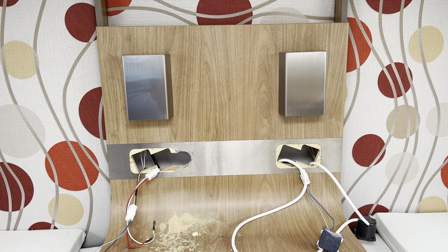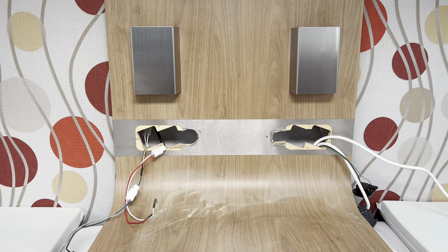Now it's down to doing the other side exactly the same - putting the mounting plate on, cutting the hole. That's the other side cut out. It does look slightly different because after breaking several drill bits and the old cutter blade - that aluminium or stainless steel strip is so tough it's unreal - I decided to use the junior hacksaw which actually got through it a lot easier.